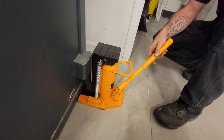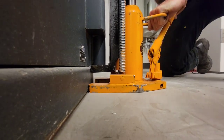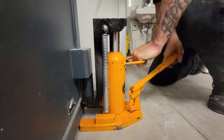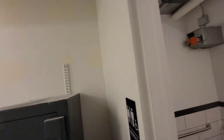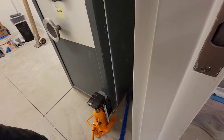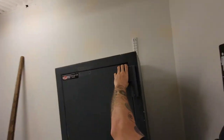Let's go ahead and start going up with it. Lifting up on the hinge is going to be the first way that will create some space underneath the safe — this is going to be the easiest way to start lifting up this massive safe that weighs about 2,800 pounds. So we're going to insert this bar over here and that's going to help it lift to the side, transferring the weight so it lifts side to side and doesn't push the safe into the wall.